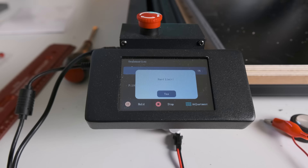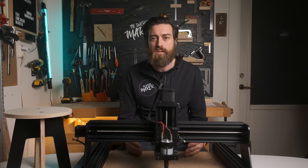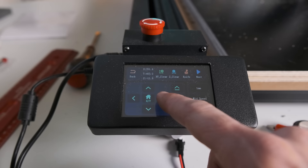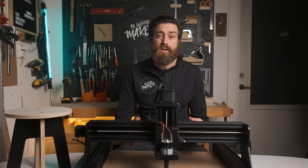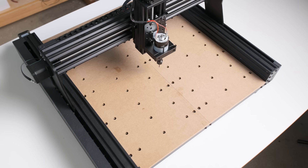I tried replacing my workpiece and tried it again, but with the same result — still hit the end stop. So I toggled the machine all the way back until it hit the limit switch. By the way, that's annoying as hell, because the display keeps saying that I've hit the limit switch, and when I press OK that message just reappears. But I realized that if I'm really quick I can move the machine right in between the messages. I tried moving the machine exactly 450 millimeters, and it can — but it couldn't go any further than that, so I couldn't actually cut my stool. A more accurate machine travel would actually be 450 millimeters, not 460 as advertised.